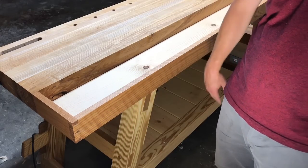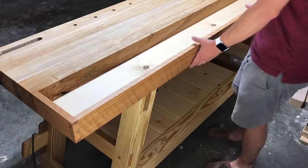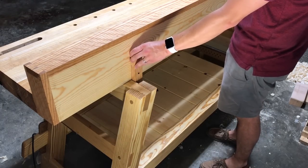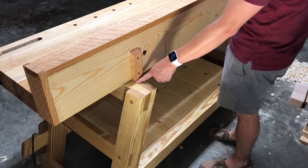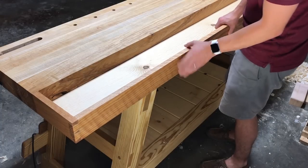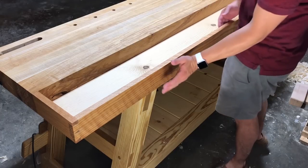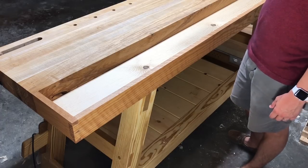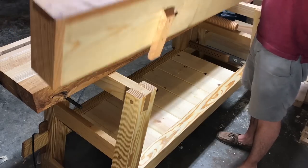It's just dovetailed red oak with a white pine floor. It also separates from the bench by pulling up from here, hitting against the short stretcher, then sliding in and locking down with very limited movement. It's pretty secure but very easy to take off, so when it fills up with shavings I just pop it up and shake it out.